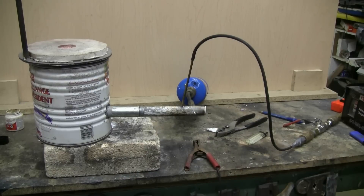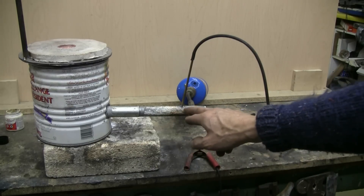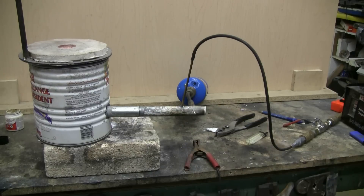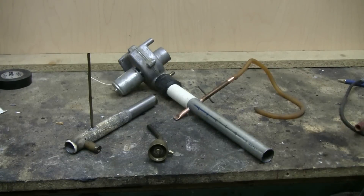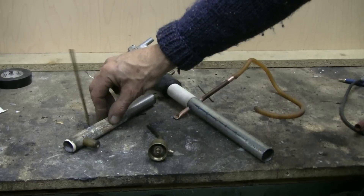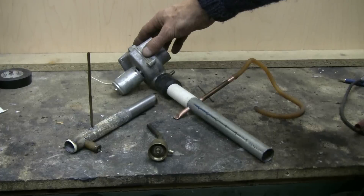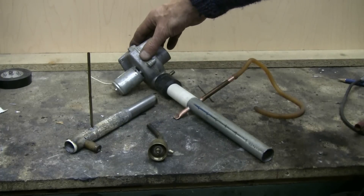I made two of these burners. The second one gets its air assist through a little brass tube that brings air from my compressor tank down and elbows in inside. Either way, it will produce a very hot running burner for the coffee can mini foundry furnace. Here's a quick last look at these two high output burners — this one which works from compressed air, and this one which I adapted to work off a surplus 12-volt blower.